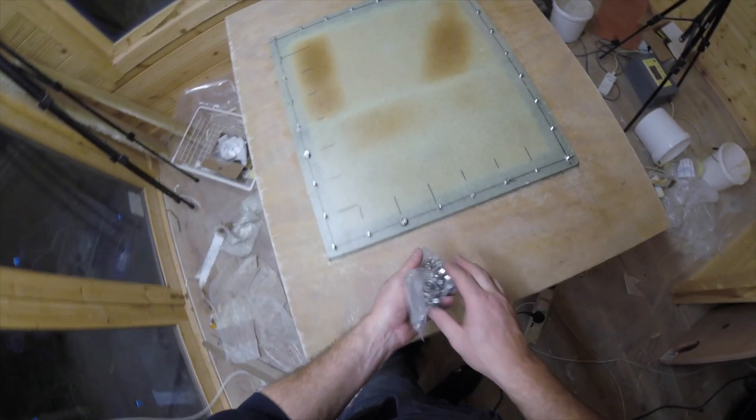My weekend's up now so I've got to call it a day and put the tools down, but I'm pretty happy with the progress. I've got the lazarette floor to a point where I can put it into the boat — the hole is cut out, all the bolts are mounted properly, the lid is made and fits over the bolts, everything aligns quite nicely, the gaskets are made, and the little covers for where the water pipes come through the floor are done. It feels like I've done a lot of work over the weekend. The next chance I get, which will be in two weeks, I can go down and fit everything into Wanda, tab it out, and see how it looks. Thanks for watching, bye for now.